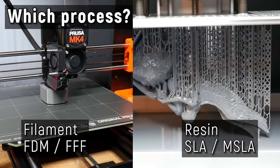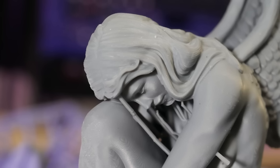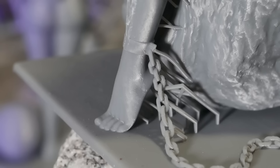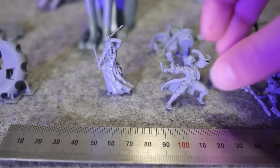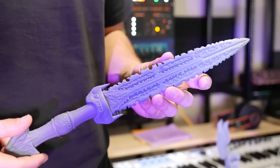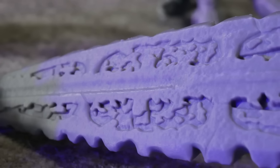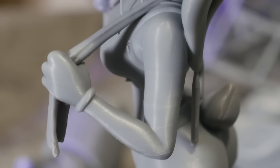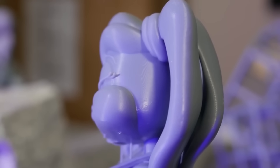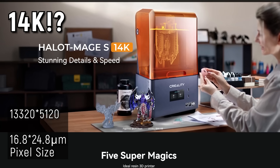You're going to print in FDM/FFF or resin. When it comes to high-detail polished models, resin is the way to go. People all around the world are already using resin 3D printers to produce miniatures for their D&D campaigns that they can paint straight off the machine after post-processing. A resin 3D printer operates at a much finer layer height than filament printers, and the screens used for the MSLA process are up to 12K resolution now, meaning individual pixels or voxels are pretty much indiscernible on detailed models.